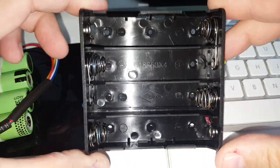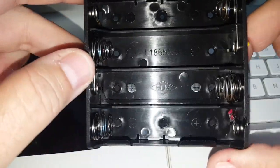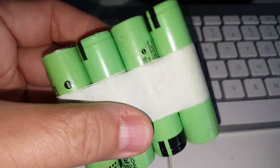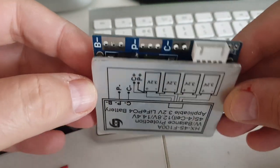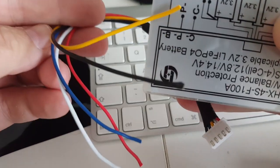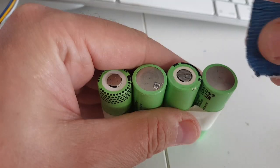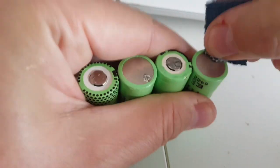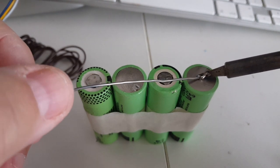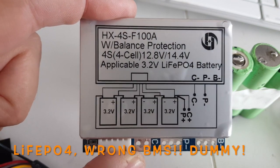For the battery pack, I tried to use the existing cassette but the springs don't have enough pressure to make good contact. So I'm going to make a pack with four 18650 cells and solder the batteries. I have a battery management system here that will go into the battery case, and I'll use this lead to connect to the battery. I'll put heat-shrink tubing on the pack and use some paper to rough up the contacts — it helps for soldering. The BMS diagram is written on the board but it's not very clear.